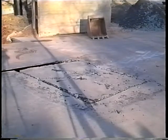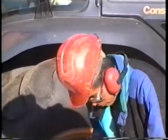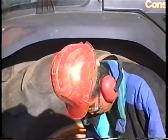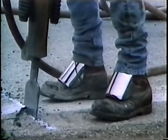The edges of all cuts should be vertical and straight. Hammer operators should be safely attired: hard hats, safety goggles, ear protection, and sturdy steel-toed boots equipped with foot guards.